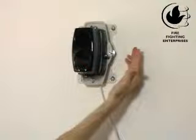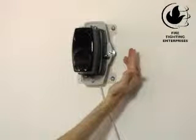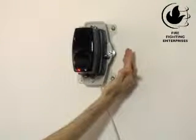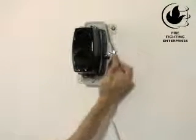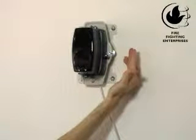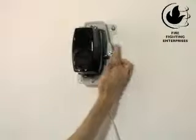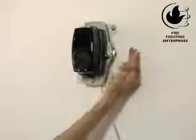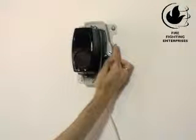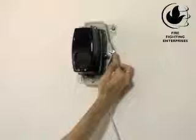Turn the thumb wheel half a turn in the same direction. Wait for the red LED to go out. Do it again. It can take up to 20 to 25 turns. Keep chasing the red LED until a turn gives no LED. Turn the thumb wheel further half turns in the same direction until the amber LED flashes. This means you have gone past the center of the reflector. Come back half a turn. Repeat this process for the other thumb wheel.